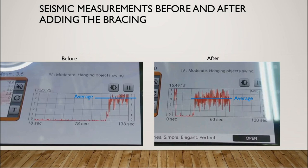It's definitely an improvement, though not as much as I was hoping for. On the other hand, my table already had extra bracing, and I've got a vertical spoil board that bolts on to two of the cross members, which helps add stability in the X direction, plus quite a bit of extra weight underneath and some extra 80/20 aluminum pieces beyond what normally ships with the table. So you might get more improvement out of the same type of bracing, especially if you don't have the drawer so you can go straight corner to corner — that's definitely a stronger configuration. But I did the best I could and I'm happy with what I got out of it.